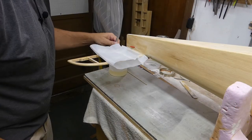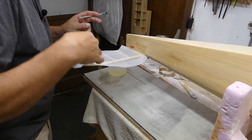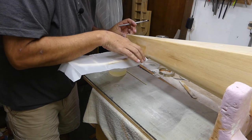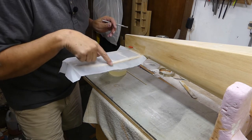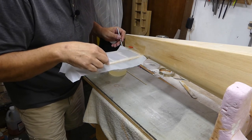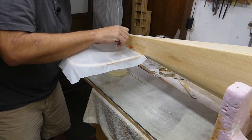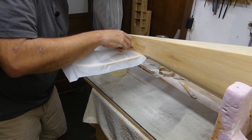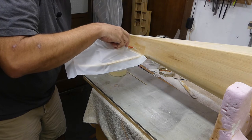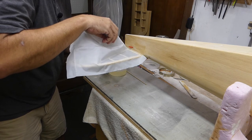I've got to finish this step first. Let's get back to work. I'm just kind of getting a start on how I want to do the horizontal stabilizers on the underside part. I'm starting with the leading edge, and of course it's upside down. It's got some poly-tack underneath here and I've got it pushed through — forced through the fabric. I'm going to go ahead and hit the rear side of it now, and see how well I can get this to adhere the way I want it to. It's not agreeing 100% — I think the technique I'm using right now will probably end up changing somewhere down the road.